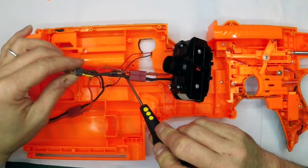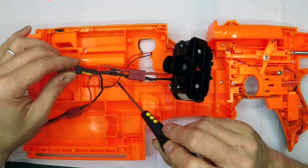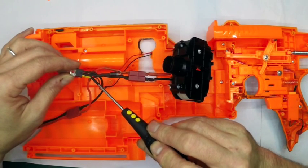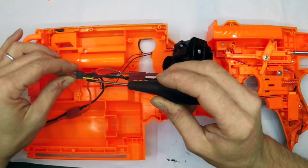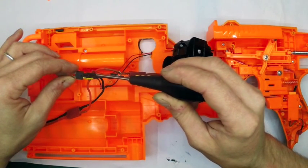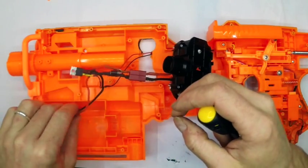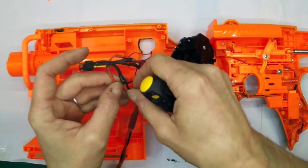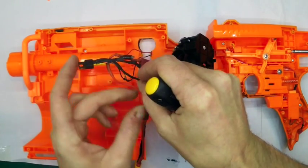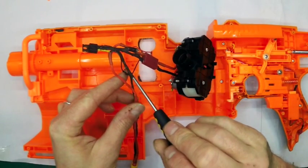Here you can see the other wire which is coming from the trigger — that's your feed out from the trigger. That is coming back here and going to the first pin, which is the gate. Then you've got the middle pin which is the drain, and the right-hand pin which is the source on the MOSFET. If you look at how that's wired, it goes to two connections — you have across there a 10k resistor.